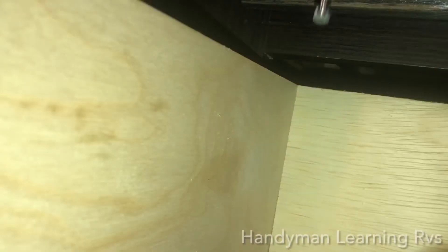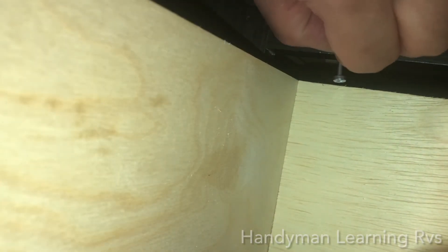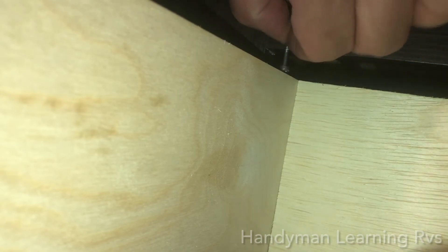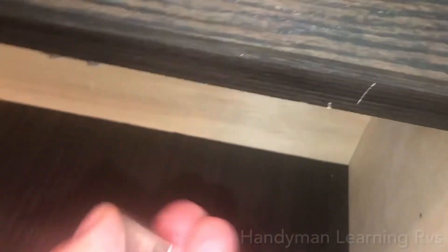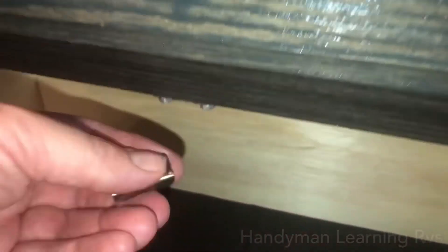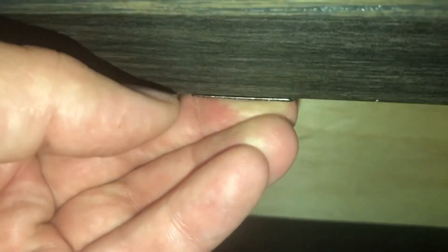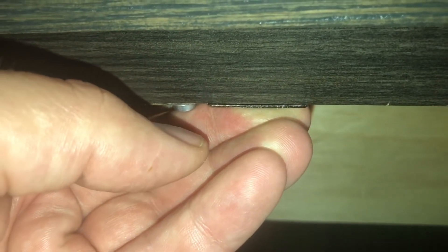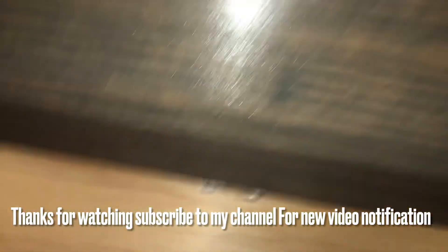But with the screws, you just back them out a little bit more. With the length of these screws, you can easily adjust how far down it comes. You can still use the screws or you can use the L-bracket — just put it in with the face flush against the front edge and put the screws in. I still use the same screws to hold it on.